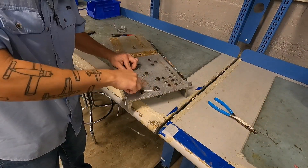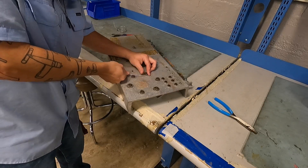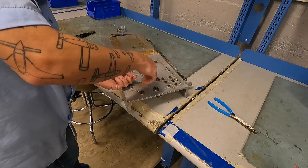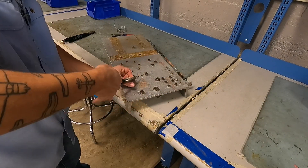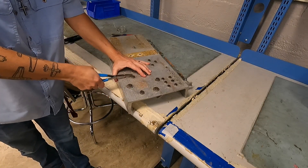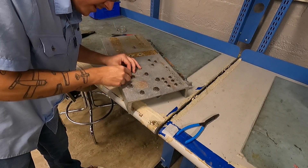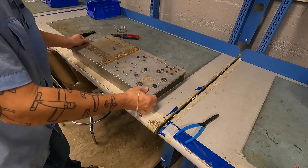I've got this all wrapped down and pulled it over here just to make sure that it's not too long, and I've pulled it back. Now what I'm going to do is open it back up, clean up this last little wrap a little bit and grab it with the duck bills. What you want to do when you grab it with your duck bills is pull on it and pull it over to the other wire - that's going to tighten this wire so that it's nice and snug. Now the wire on the top, you want to go in first with.